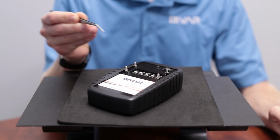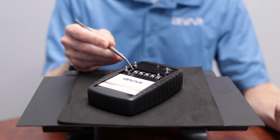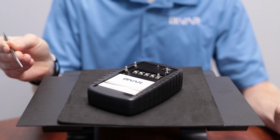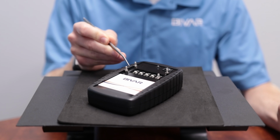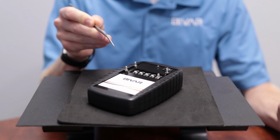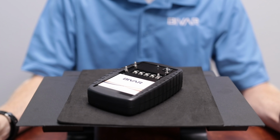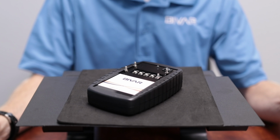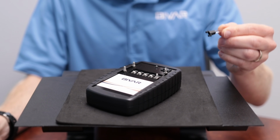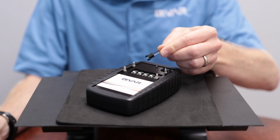An LED is first installed on a PCB following the recommended mounting area listed on the assembly drawing. Once the LED is in place, the recommended mounting holes are drilled around the LED to allow the light pipe adapter post to mount to the board and properly position the light pipe above the LED. Proper positioning will allow the LED to transmit light efficiently through the light pipe. Once the PCB is ready, the light pipe adapter is simply inserted into the board.